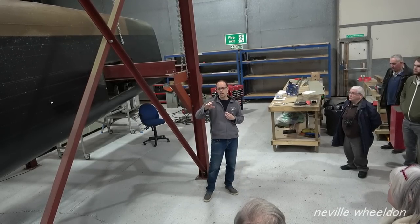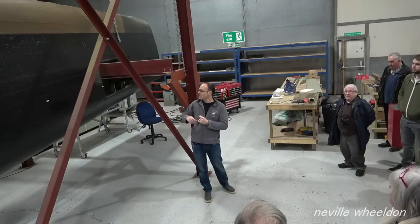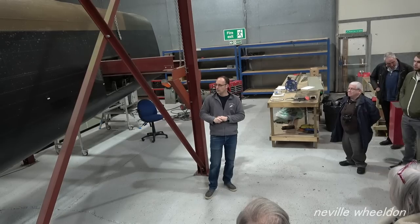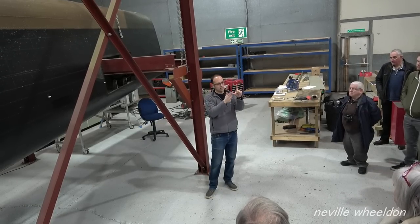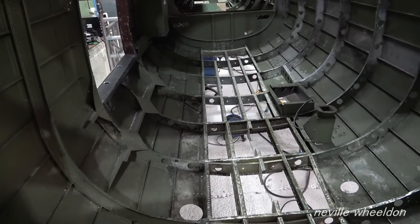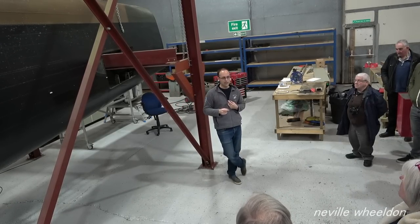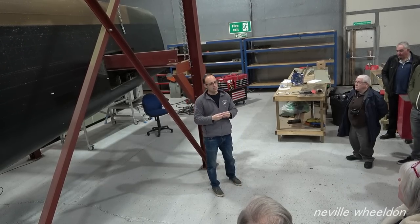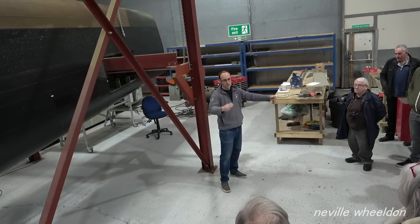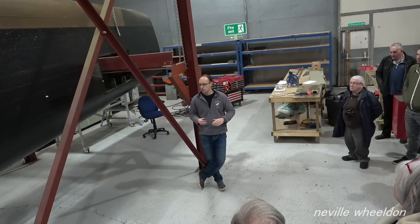The Lancaster has different-size stringers depending on which piece of fuselage it is — they couldn't make it simple and use one size. The rear fuselage and the nose have a thinner, smaller stringer — slightly thinner material and shorter legs in both directions. Back in 2019 we ordered a load of new stringer sufficient to replace all the stringer in the rear fuselage and nose if needed. That stringer is on the shelf — it was extruded in America, meaning aluminium forced through a die of the correct shape, in one length, heat-treated, and then sent over.